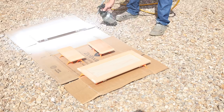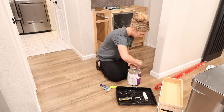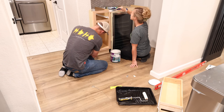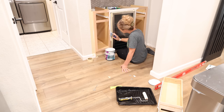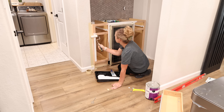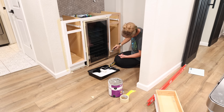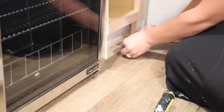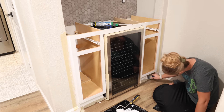Now it's time to start painting the cabinets. We decided to paint them white — it was a safe choice, and if I ever want a darker color we can do that later. The white did start to grow on me once the space was completely finished. This is the same white paint we used on our kitchen cabinets. The first step was to remove the cabinet doors and drawer fronts. We took those outside and set them up on these little orange cone-like things — you can buy them on Amazon or at Lowe's or Home Depot. They're a must for painting cabinet doors and drawer fronts. Jalen sprayed the doors and drawer fronts while I used a brush and roller to paint the outside of the cabinets. We didn't bother painting the inside — same as we did in the kitchen. Then Jalen added the trim, finishing touches around the edges, and caulking.